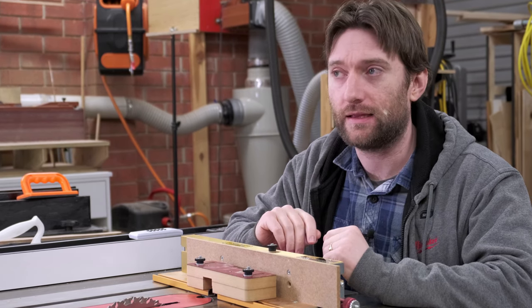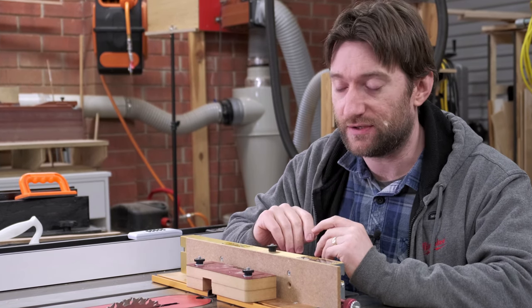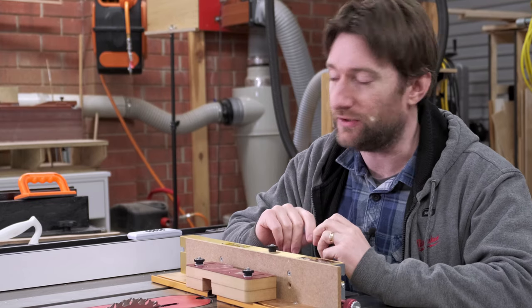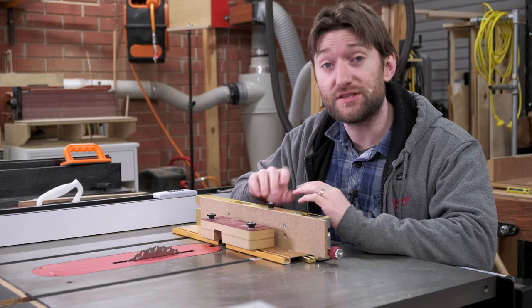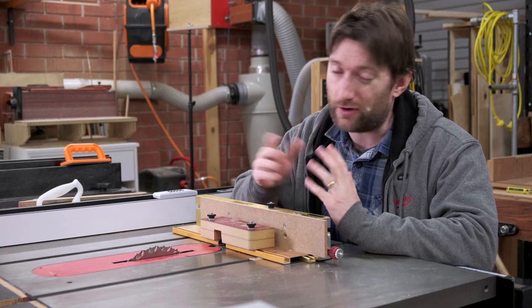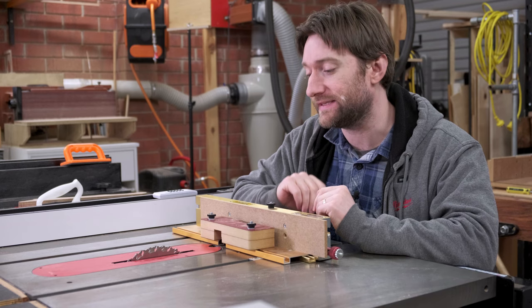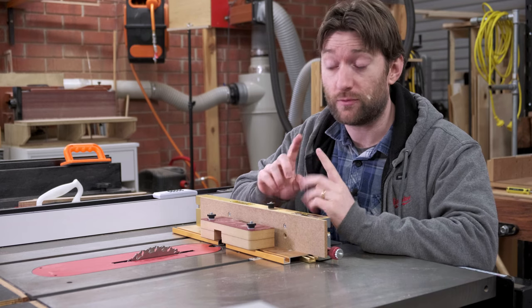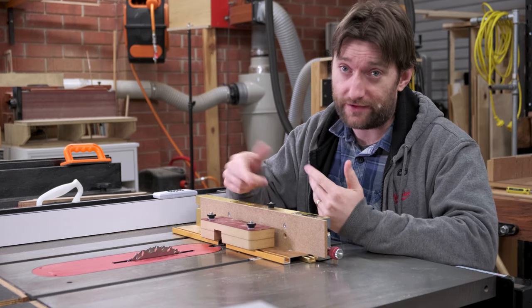The table saw is going to be a little bit quicker. The router table is going to limit you to whatever size bits you have, whereas a table saw you can use a dado stack and shims to get the exact size. I'm using the iBox from Incra. I bought this a few years ago when the Australian dollar was a lot more favourable. But there are plenty of commercial jigs that work on either the router table, table saw or, like the iBox, both.